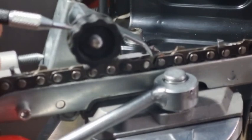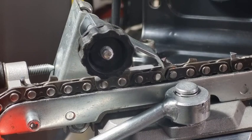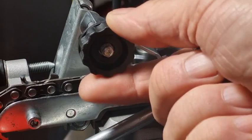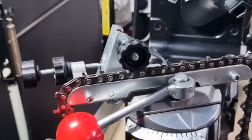The only criticism I really had was this particular wheel here seemed to come loose a bit. One of the easiest ways to stop it coming loose — on original Oregon ones they're plastic but have a tapered thread, and they encase a nut inside the plastic. So the wheel spins fairly free and the side plate can move. Get yourself a bit of Teflon tape, wrap it around about three or four times, and you'll find it's got a bit of tension and the vibration of the grinder doesn't make it come loose. That's just another technical tip.